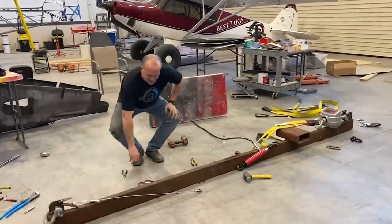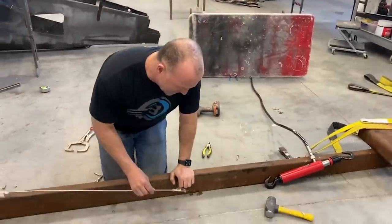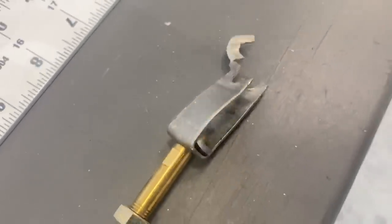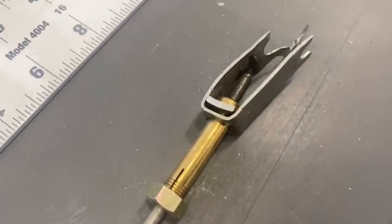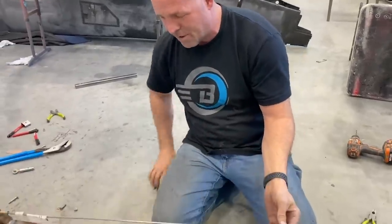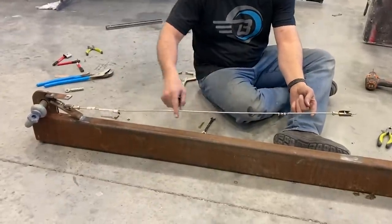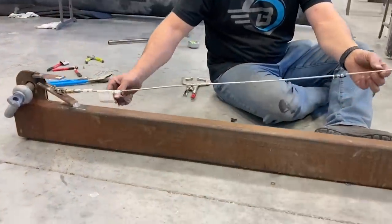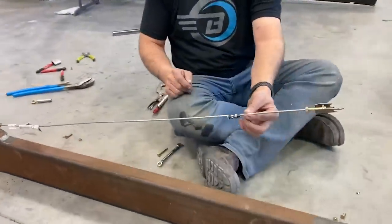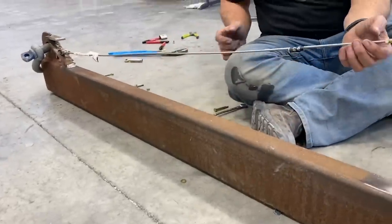And the absolute failure, wow, look at this. That is cool. The complete total failure occurred at the end, which was odd. This was the third thing to show an indication of failure. First was the bar. Now look at that bar. Can you guys see that? This bar is so stretched, it has not returned to its original shape. Look at that bar. That bar was perfectly straight. We stretched it so much that this bar is completely deformed.